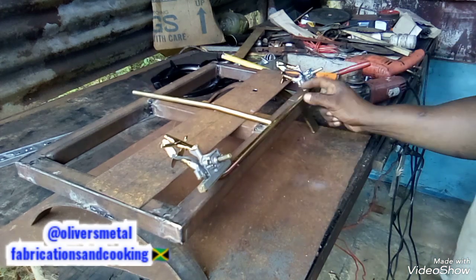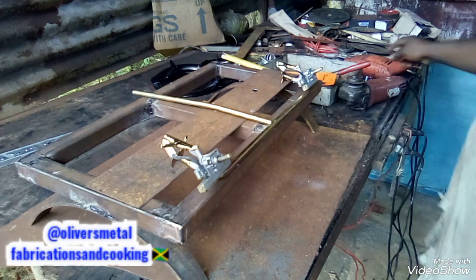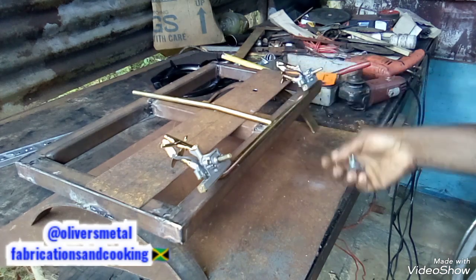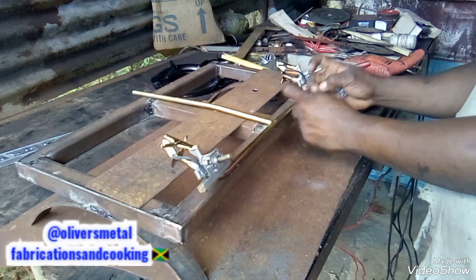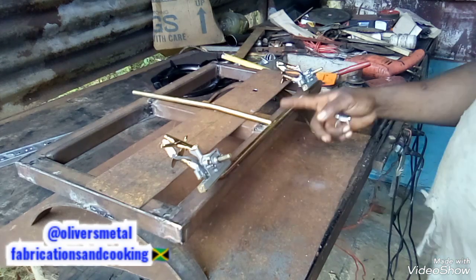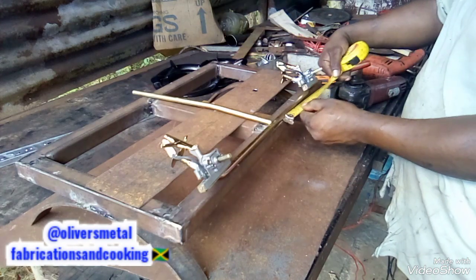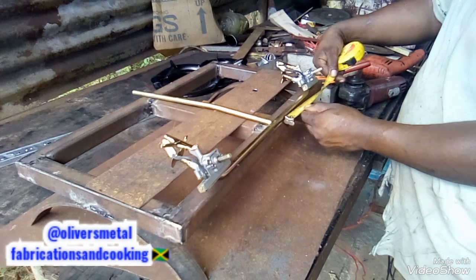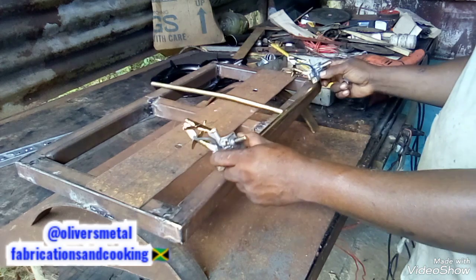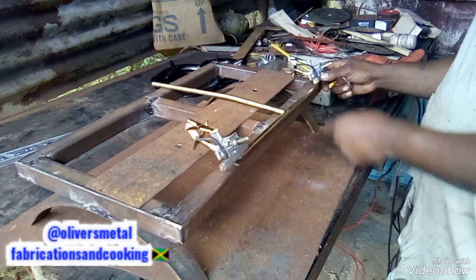Take out a piece and carry this side closer, and then use these adjusting straps to belt the rubber in between and hold the pipe between, here. So I'm gonna cut and take out about 2.5 inches out of it and carry this piece up close, so that when this one is centered here, I also get this one centered right here. Okay,